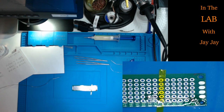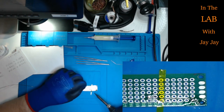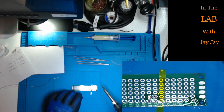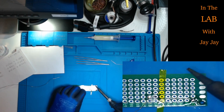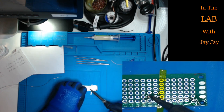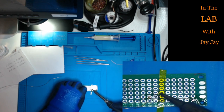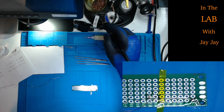All right, so we're going from 21B to 17A, so that's just back down, and we're going to use the next size bodge wire, which is the medium size. So let's just angle him in this way. And I might just use my little thing. Now I'm burning the new one in, and hopefully not affecting the one that we already had in place. That looks like I've done okay to me.